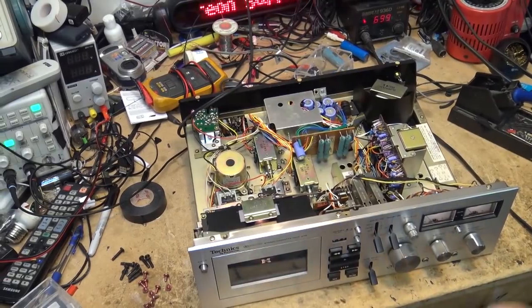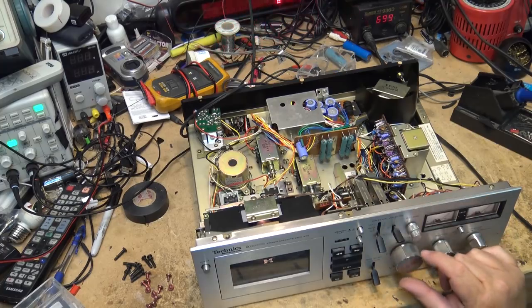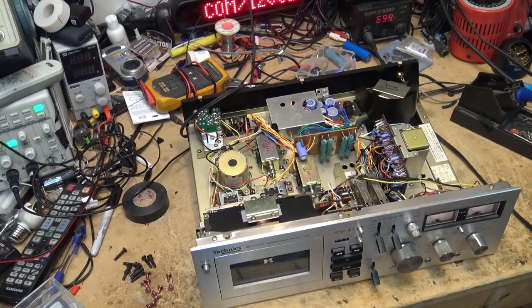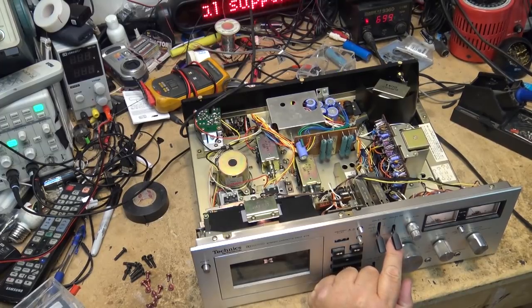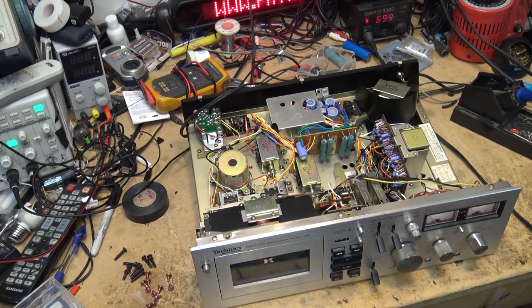Here's how the Dolby FM works: if you've got your tuner plugged in and you flip it to Dolby FM, that switches the Dolby FM circuits in. If you're receiving a Dolby FM broadcast, when the station sent out their calibration tone you'd flip the Dolby FM switch on and adjust it to plus 3 dB — that's where the Dolby indicator is. That's where you set it up, and it was calibrated. It only took a minute or two when the stations were at it.